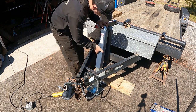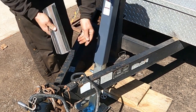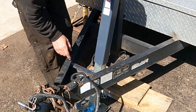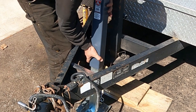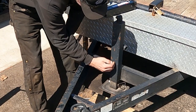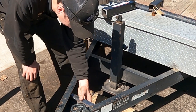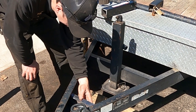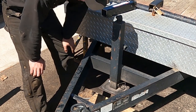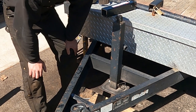I've got this laid out in here. I've taken a piece of probably one-and-a-half by three channel — like a smaller version of what the trailer's built from — and cut it to slip in here to weld into the inside of the tongue and weld to the front. I can use a framing square off the front of this to line up and get everything square in the frame. I'll tack this in place, then take the guts out of the jack and get it set up. You should probably disassemble it rather than weld with the parts inside.